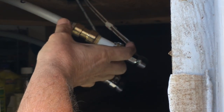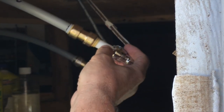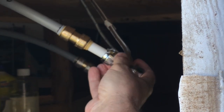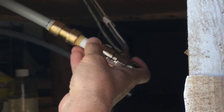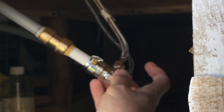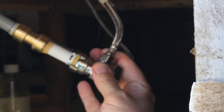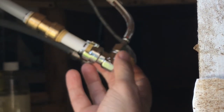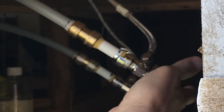Make sure the gray is to the gray. And then for this tan side, your PEX goes in here — a little short piece. Then you take your SharkBite valve and slam that onto the end of the PEX. And then my new faucet connected right here. This was a three-eighths — standard three-eighths. They also make them in a quarter-inch, but I had a three-eighths. So this is half-inch to three-eighths. And that was it. Done.